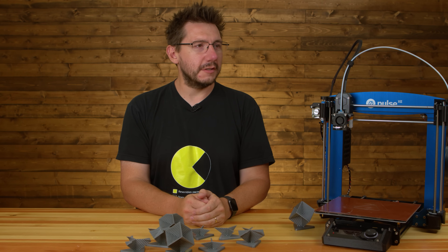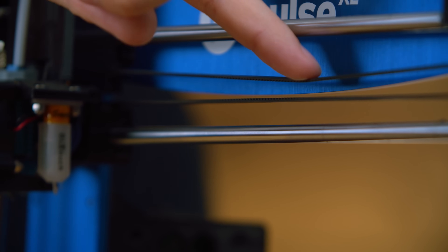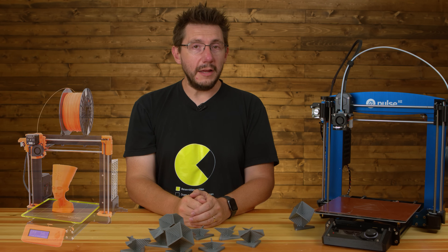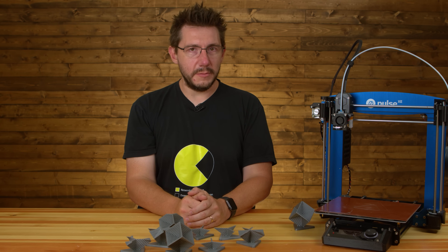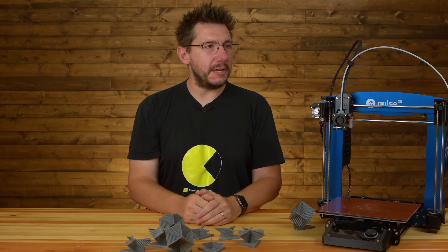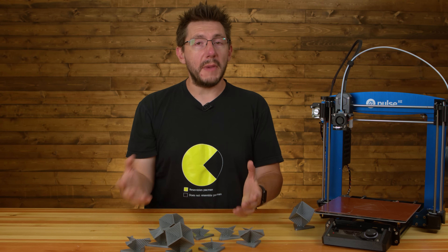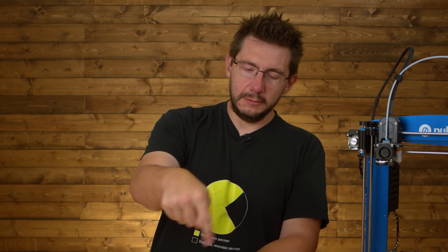Someone out there is going to say your belts are too tight or too loose. I judged the belt tightness against the Prusa i3 MK3 — it has very similar belt tightness on X and Y, and that machine is able to produce the models — so I don't think this has to do with belt tightness. I know some people might see this as a failure, but this is the whole point of having a mechanism for updating software. If anyone had this issue with Matter Control, MatterHackers would take it in and implement software fixes. We'll put a link to the model in the description — I'd love to see what you print it with. Tag me on Twitter at Joel Telling, and tag Sean too.